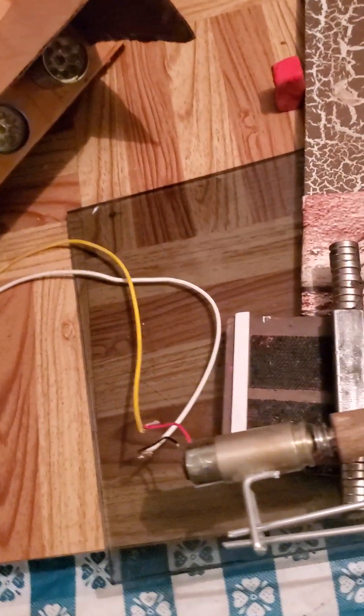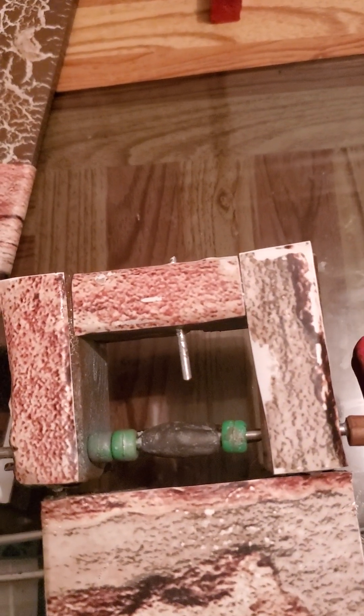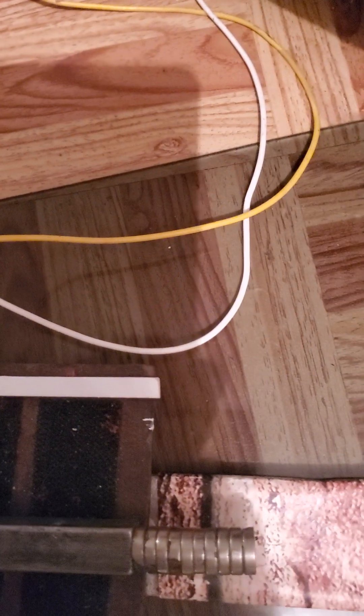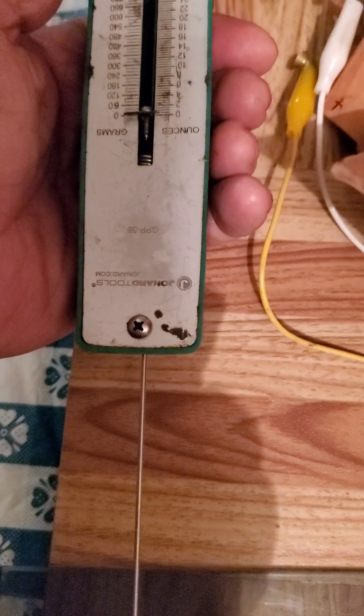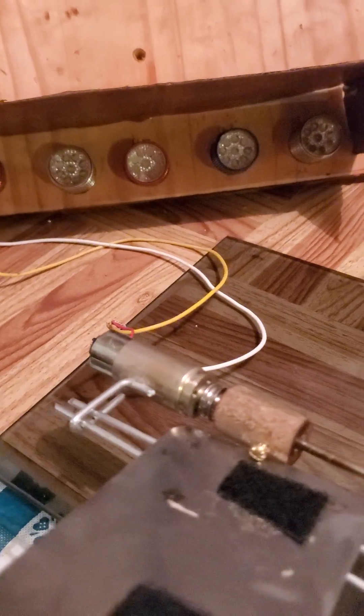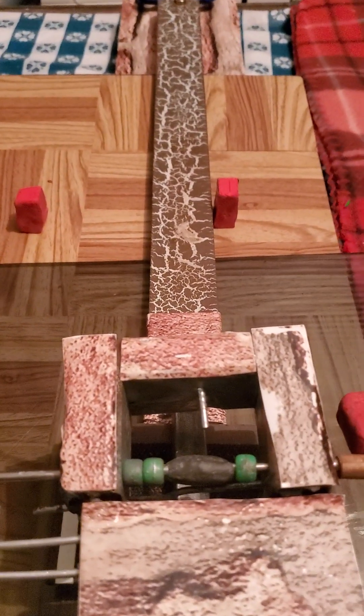And see, that's very, very small. I'll go ahead and put my trigger in — I do not want my flapper to fire until I'm ready. So I'll take my ounce gauge and measure the force to engage it. You can see that was very, very small.